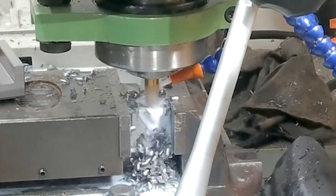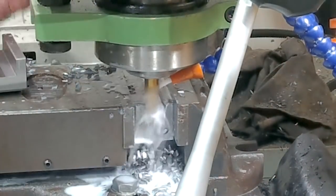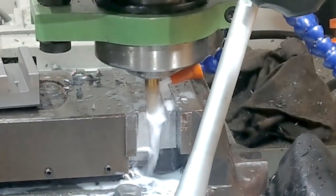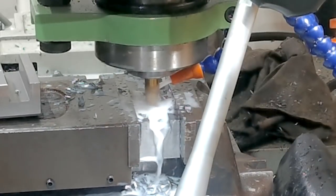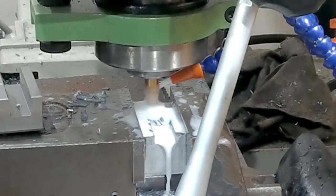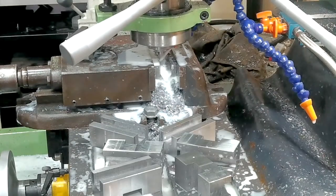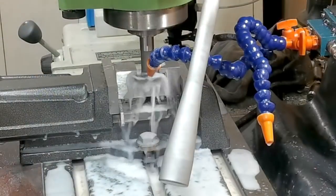I'm using an 11mm 2-flute cutter to machine this 16mm wide slot for cutting the tool holder. I'm working at a depth of 7.5mm at a time at about 20mm a minute, estimated at around 1000 rpm. The only limit I need to worry about on this side is that the bottom face of the tool slot is true to the outside top and bottom dimensions and in turn true to both of the offset slots on the T-slot side.